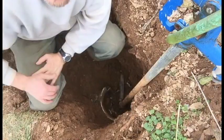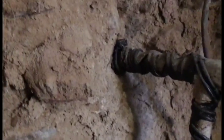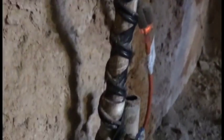I just realized that there's pressure in this water line, so I need to turn that off at the source. Yeah, this is the supply. So on the other side of this stone wall in the basement, we're in the basement of Summer Kitchen right now, is this pipe comes out from the well, comes up out of the well, tees, half of that tee goes out to the outbuildings, the other half goes into the house. Then it goes down there, and that follows out that door. That's where the supply is coming from. You can hear there's a leak in this valve.